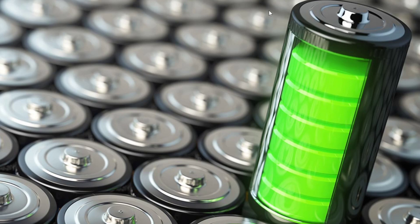One of the problems with the way people think of rechargeable batteries comes from the past. A long time ago, the main batteries we would use were NiCADs — nickel-cadmium batteries. Those were the only rechargeable batteries available for a while, and they had a flaw. When you would not discharge them completely, they would actually have something called a memory effect. It wouldn't charge past a certain level, creating a problem where the cell would not last very long and not hold a charge. Unfortunately, that way of thinking carried forward with today's rechargeable batteries — and it's totally wrong.